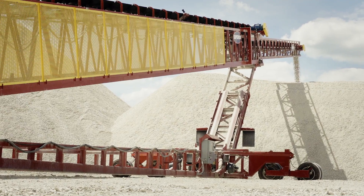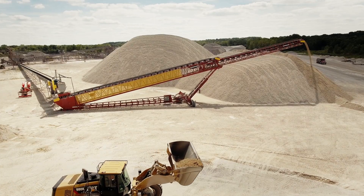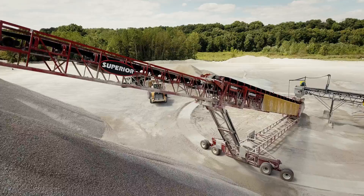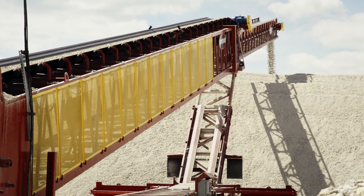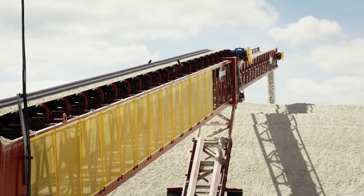The lower cost swing axle becomes a neat feature for folks that do want a swing axle and be a little more portable. We designed and brought to market the fully braced undercarriage, our FB undercarriage. With that, the inner and outer arm are locked structurally together, so when the machine is fully raised, you won't see the side-to-side deflection that you could get without that bracing.